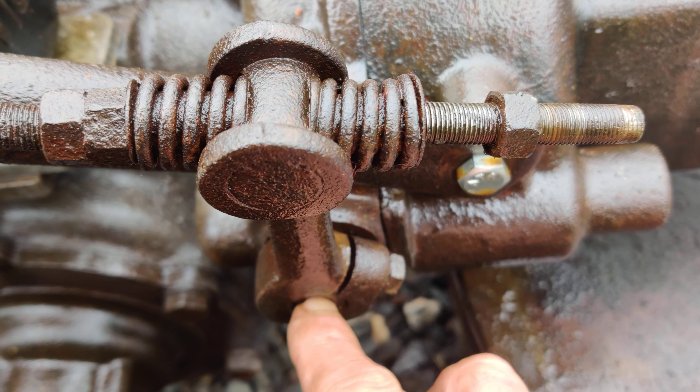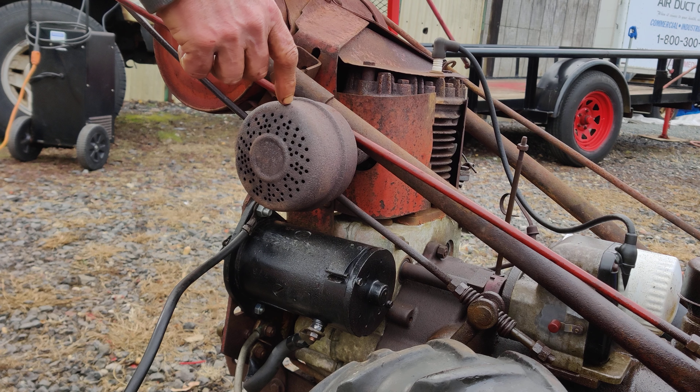Low gear, high gear — one seems to be good. I figured it was supposed to move, and it's moving real nice now. That's probably how the old forward-reverse rod got all bent up — sorry for the language — somebody was trying to force it. Look how easy that moves now. So because the lever was stuck, this rod here wanted to bend up all the time — it was bending up because it wasn't pivoting down there.